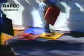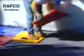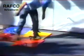Place the mats on the concrete, one after another, taking care to keep the tools tight together. This is probably the most important thing to remember. Keep the tools tight. This will prevent double lines and keep the tools running true.